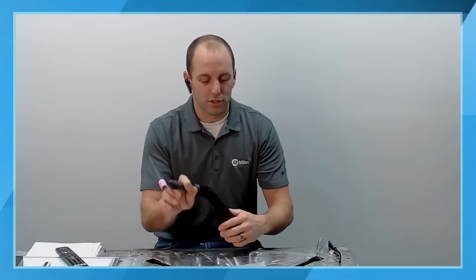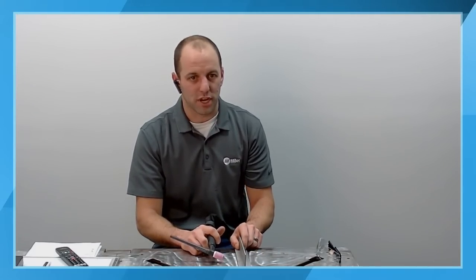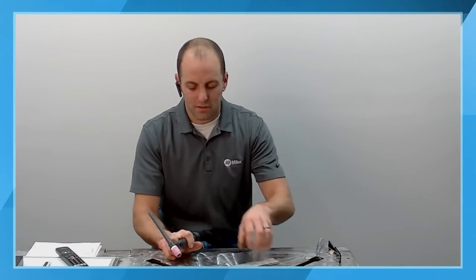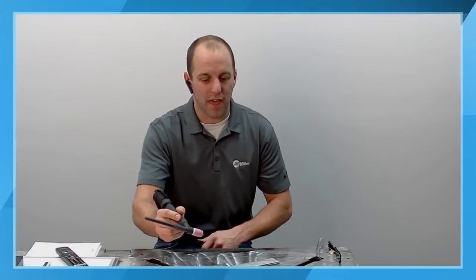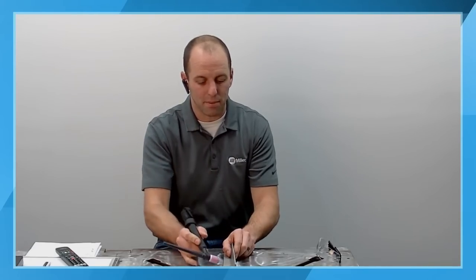There's different ways that you can hold the torch. If I'm doing a fillet weld, for example, and I have the members straight up and down, I'm going to turn that a little bit on an angle, and I'm actually going to hold the torch in a modified pencil grip, you might say, where the torch comes through my fingers. I don't know if you can see how I'm holding this, and it's actually going to be pointed in towards that joint. If I'm maybe welding towards myself, I can still maintain that configuration, the standard pencil grip, again, finger on top, and just simply come down, move that towards me. It's going to be difficult to add filler rod in a configuration like that.